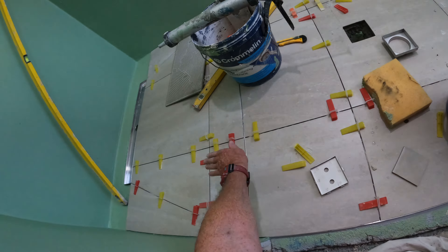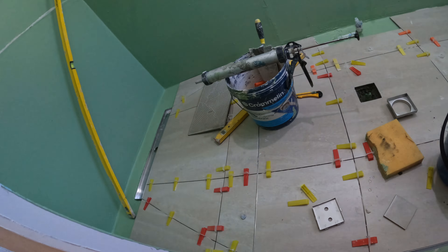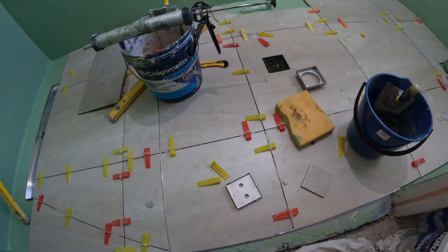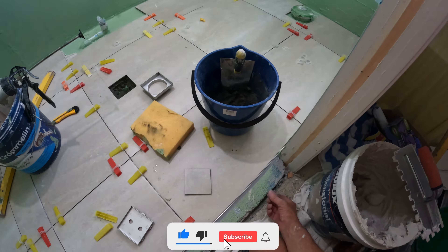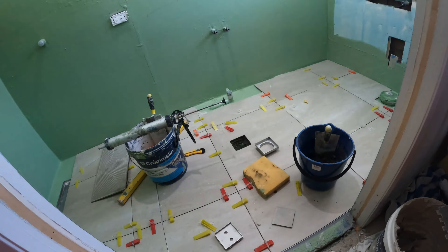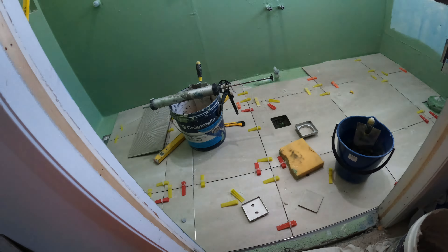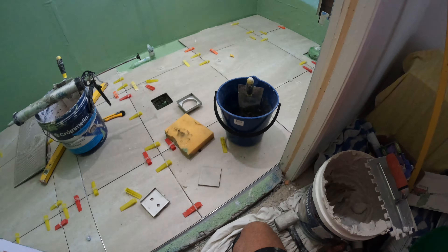See how you've got a beautiful walk-in shower. On some YouTube videos I see that they jackhammer out the concrete floor — what a job — or they cut down the joists to make it lower in the shower so they can stick down the rest of the bathroom floor. Just build the sucker up! This is only 20mm above my carpet. When you're opening the door — Australia is used to this — you're stepping over 20mm, which is three-quarters of an inch, instead of chopping down your joists or chopping into a concrete floor. That's a biggie.